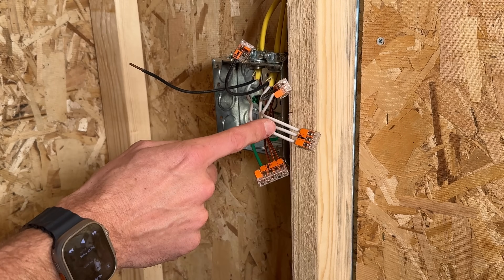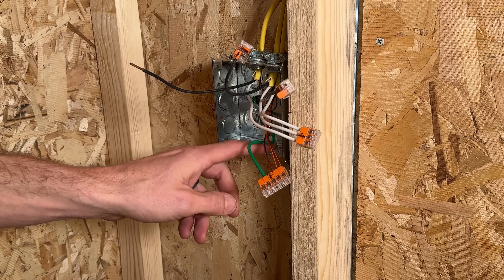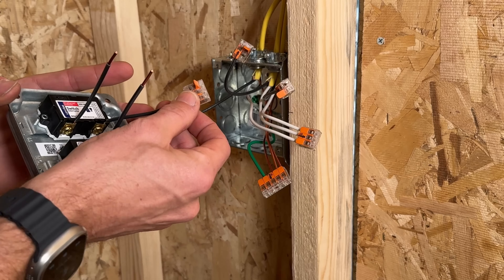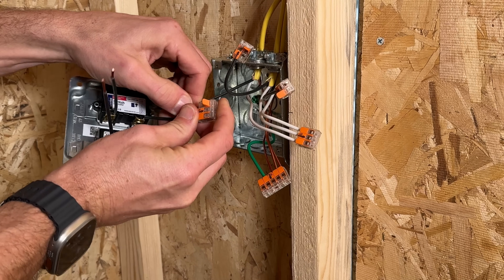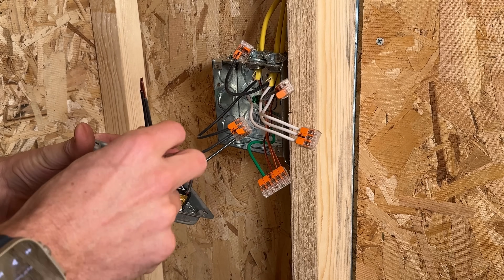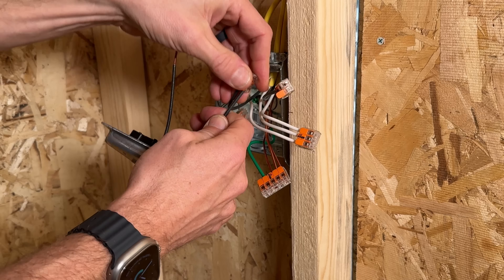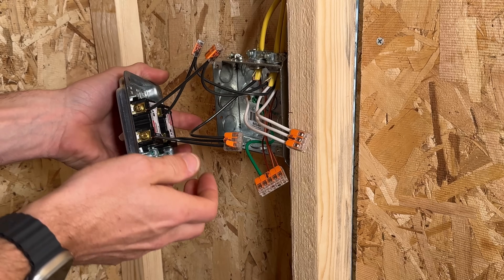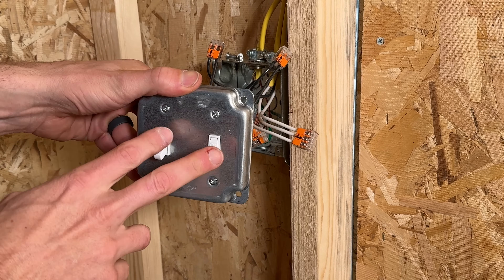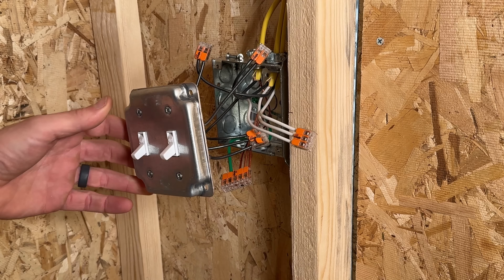Now I'm going to bring together my two switches — these are just standard single-pole switches. One is going to be for the exterior light right next to the door, and one will be for those interior lights. Just to note, I'm not grounding these light switches directly — these switches have self-grounding yokes, so when I connect those to the cover and then the cover to the box, because we have our ground coming back to the grounding screw, that will bond everything together. I have my neutrals from the three sets of Romex coming together, grounds coming together with a pigtail from the box, and power from the hot coming in goes into a three-wire WAGO lever nut — one hot switching the exterior lights, one hot switching the interior lights.